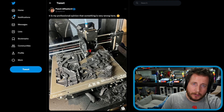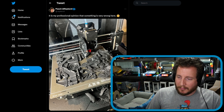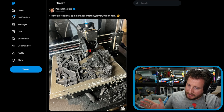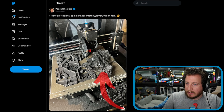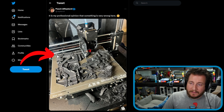Starting off, we have my buddy Pooch from Repcord and Prusa, who's got a Mark IV with a Mark III bed on it. I'm glad that they've looked at adjusting the branding on the beds. It's using a texture plate that is printing parts. We've got a Mark IV, which should do perfect first layers — it uses a load cell for first layer calibration. But we can see here that the entire right side of the print has come up, and some of the left side has already started lifting. And even in the back, we have some issues as well.